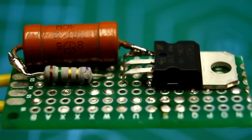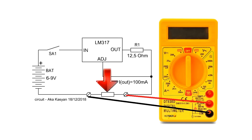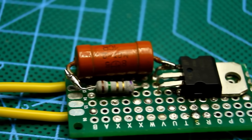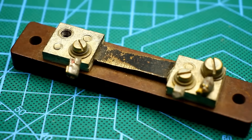Voltage, current, and resistance are closely interconnected — as demonstrated by Grandpa Ohm. When a low-resistance resistor is connected to the output of the circuit, a voltage drop occurs across it, and the multimeter will simply show this drop in millivolts. The output current from the stabilizer is 100 mA, so 10 mV on the multimeter display means the resistance of the test resistor is 100 milli-ohms. This meter is capable of measuring resistance from 0.001 ohms.